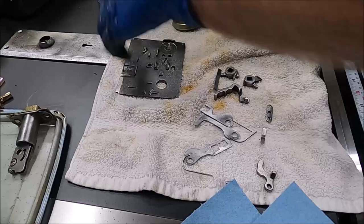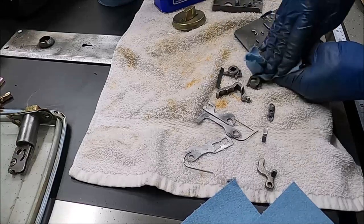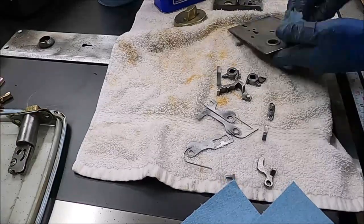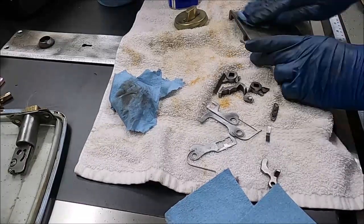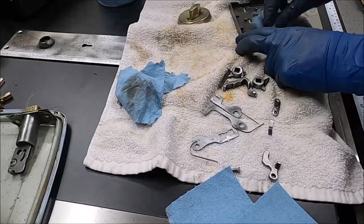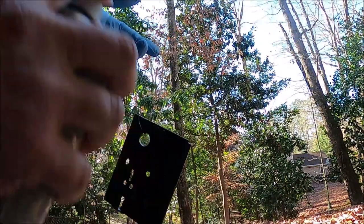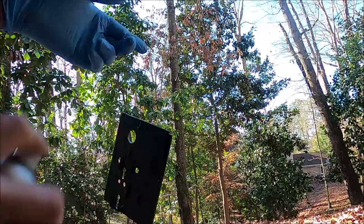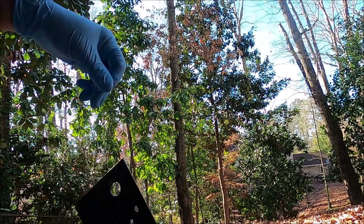This was one of the more enjoyable parts — trying to dissect, clean up, and get this whole mortise and lock set back together. I used acetone to clean it off before spray painting it. I took it outdoors and put two or three coats of black spray paint, and then once that dried put two coats of clear lacquer on top of it so it would keep it looking pretty a little bit longer. It's going to be inside the door so nobody's going to see it, but I want it to look as good as possible.